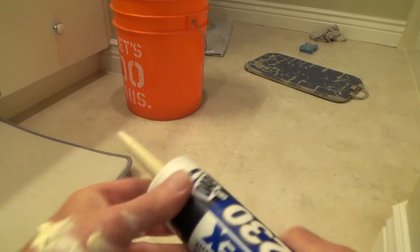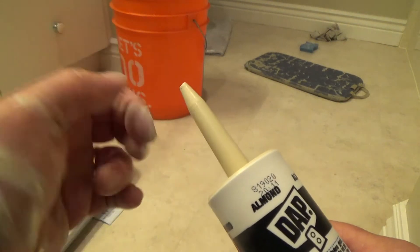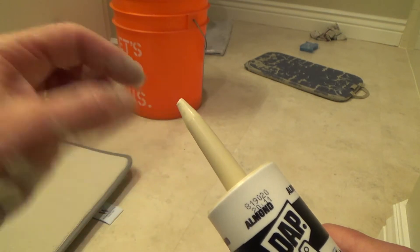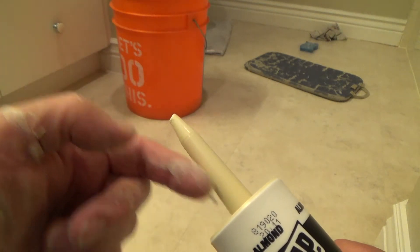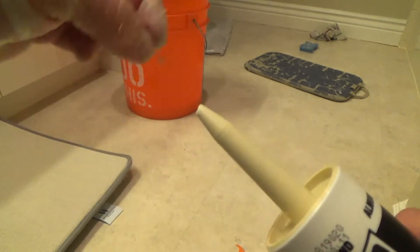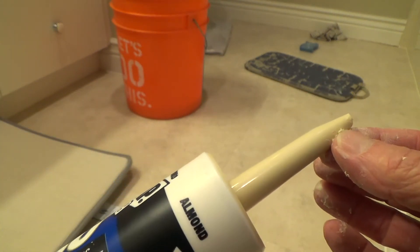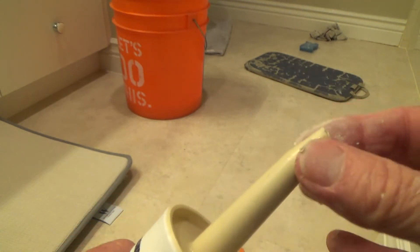You could put a long nail in here — a really super long nail, a galvanized 16 maybe — shove that in there, or a long drywall screw, a three-and-a-half inch drywall screw. Drive it all the way down in there, take it out, screw it back in back and forth with a pair of pliers, and you can kind of clean out some of that dried caulk that way too. I have some three-inch drywall screws and I'll do that before this dries out.